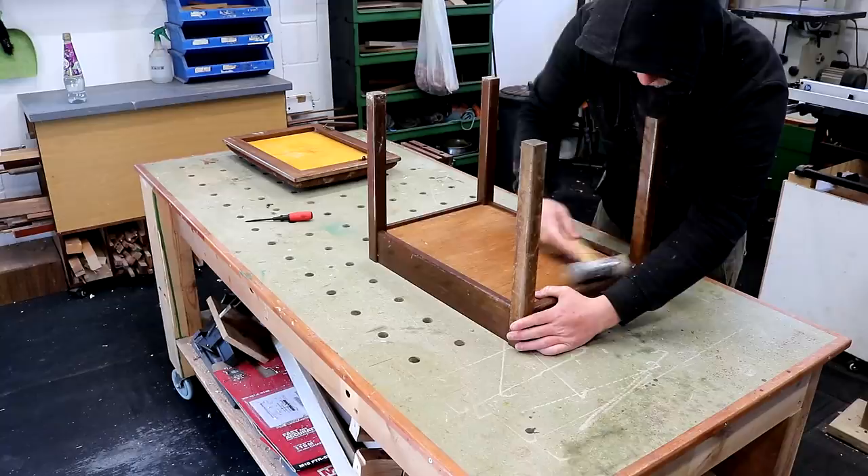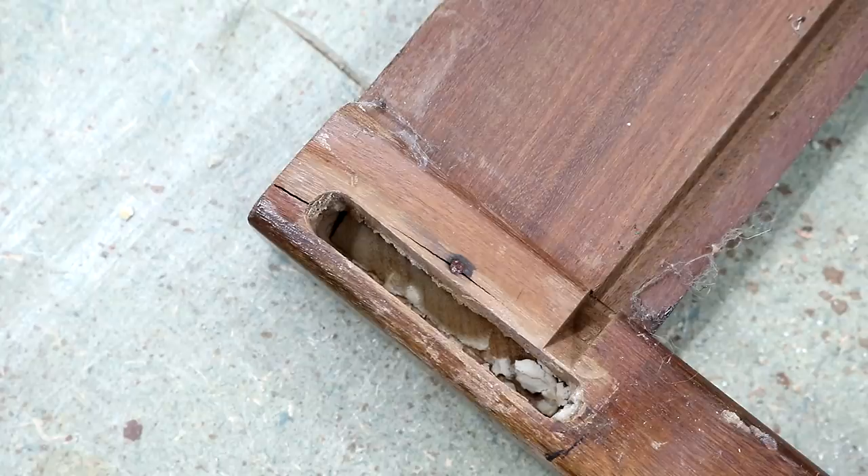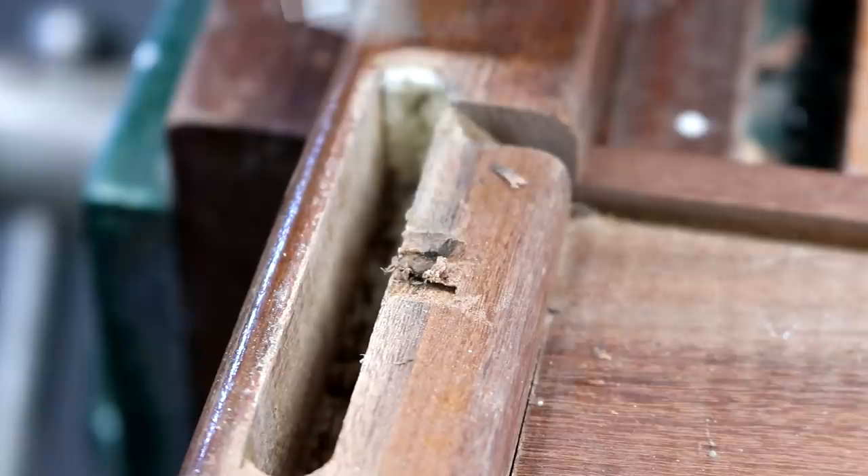I started working on the loose glue joints, so I got my mallet to disassemble it. When I got it apart I found my first problem — one of the loose joints had been pinned with a nail through the leg and into the tenon on the apron rail, pinned on both sides. I think this is probably original, not a repair attempt. These nails will have to come out, and that means making a bit of a mess of the surrounding wood, so I used a chisel to give me better access to the head of the nail.